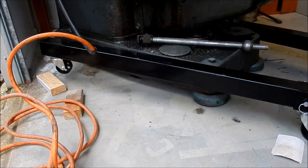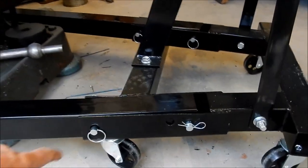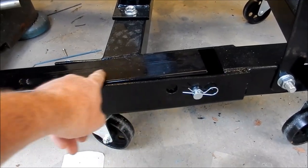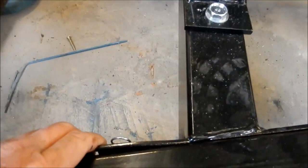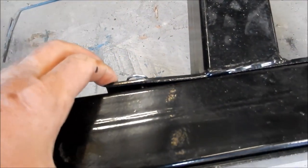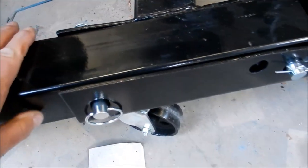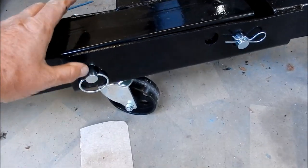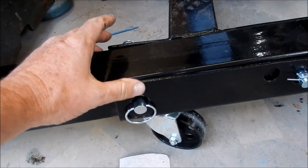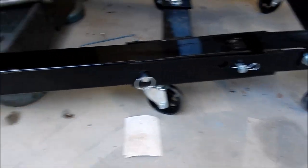You might have seen that - it was listing like the Titanic off to one side. We've got the next mode of failure, which is right here - we've actually put a decent bend in it. When it went down we've actually opened that cheek up a little bit too, so we'll need to get that sorted out. I might do some more plating inside there. You can actually see how it's pulled the cheek in on one side and opened it up on the other - that's our next mode of failure.